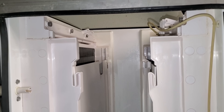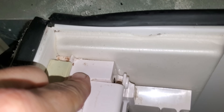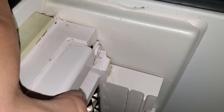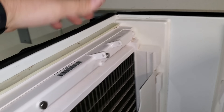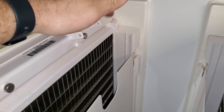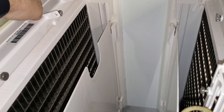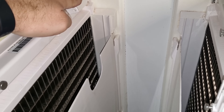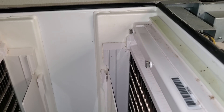We're going to try this cycle again and see what happens. Another thing I'm noticing is they're missing a screw, and you can see the spray rail is not pushed all the way in. The cleaning people that clean these machines aren't putting them back together right — that's going to not let water flow evenly across this grid. It's not the end of the world, but certainly not correct. We'll put one of those little stainless steel thumb screws in there before we leave.